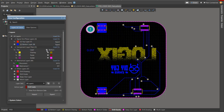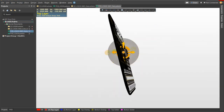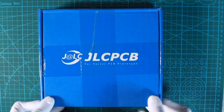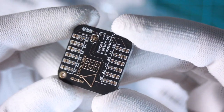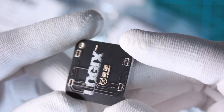Here is how the tag looks in 3D view. The tags were shipped alongside the master board from JLCPCB — you can combine several PCB designs to get them shipped together, and this is what I did. I also ordered a stencil for the solder paste deposit, which made the assembly process a breeze.